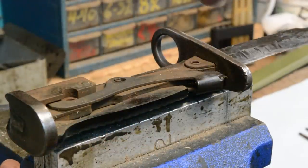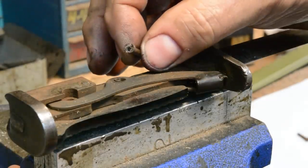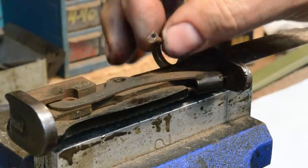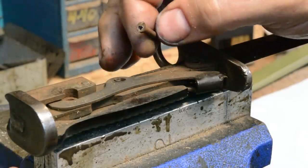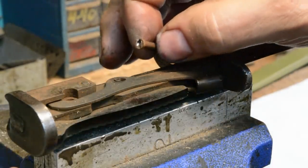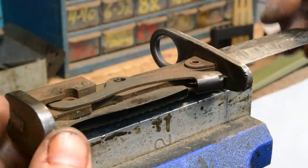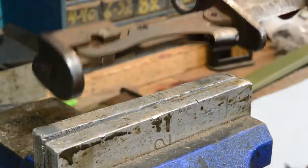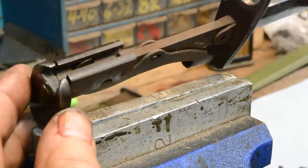So we managed to get this bayonet off the M14 apart. And I'll show you that we had to drill a hole in the screw heads to do it. We had to bore a hole down through the top of this screw and then put an easy out in it to torque it out after it had been soaking in Kroil for about 3 hours to dynamite that apart. We're not going to take it the rest of the way apart. We're just going to convert it as it sits because some of these things are riveted. Some of them are roll pins.